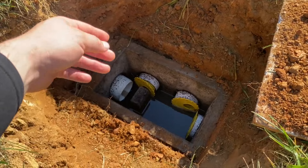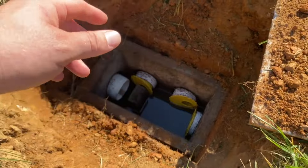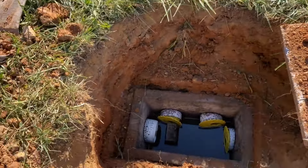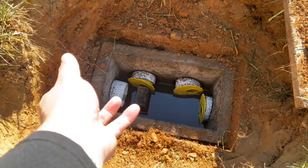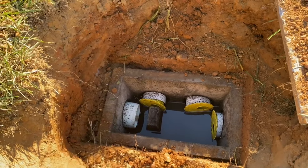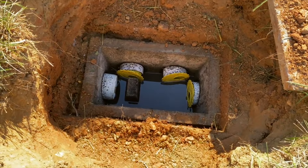How these are measured is you start running water from the back line, and then basically as the water's running, you just spin these things back and forth. They're real simple devices — they fit into the four-inch pipe, you just slide them in place and then rotate them. We've got three of them so that we can evenly disperse into all three of our trenches.